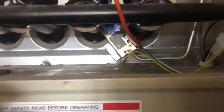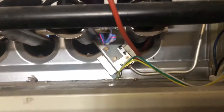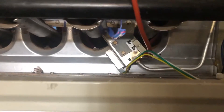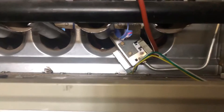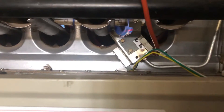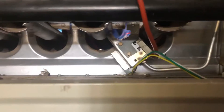Once you get the new one in, you just unbolt that bottom bolt right there — you can see it, there's that bottom one. It's an 11 millimeter. Once you loosen it, tighten it back up, just snug it up. It's a flare fitting, so it fits nice and tight — you don't gotta worry about any air, gas leaks, or anything like that. It's the way the fitting's supposed to be.